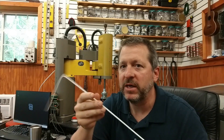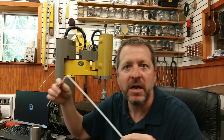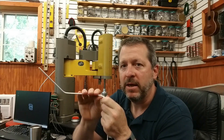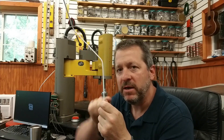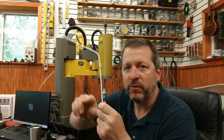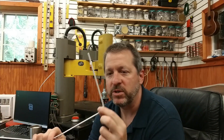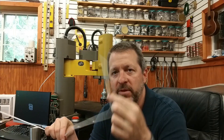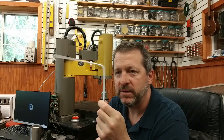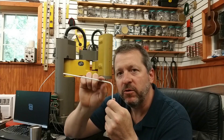What we want is wires that are 3D in nature — bending in all possible directions. That means extruding the wire, then bending it, extruding again, then rotating, then bending. In every case the bend is done in the same direction, but we rotate the wire a certain amount and then perform the bend a certain degree. So you have three numbers that drive this process: the distance to extrude the wire, how far to rotate to the next plane, and how far to bend.